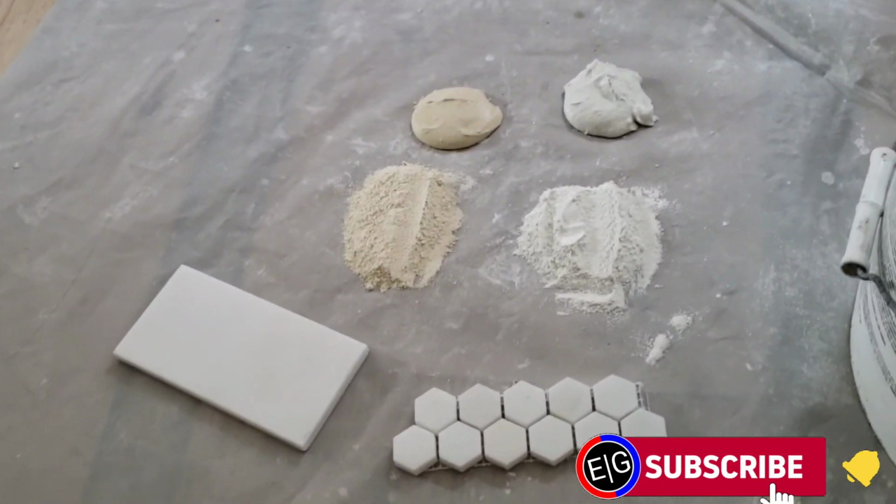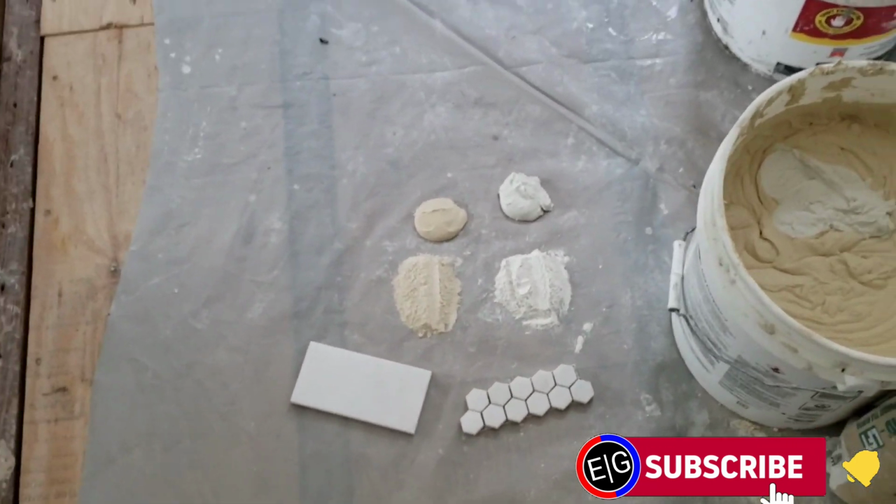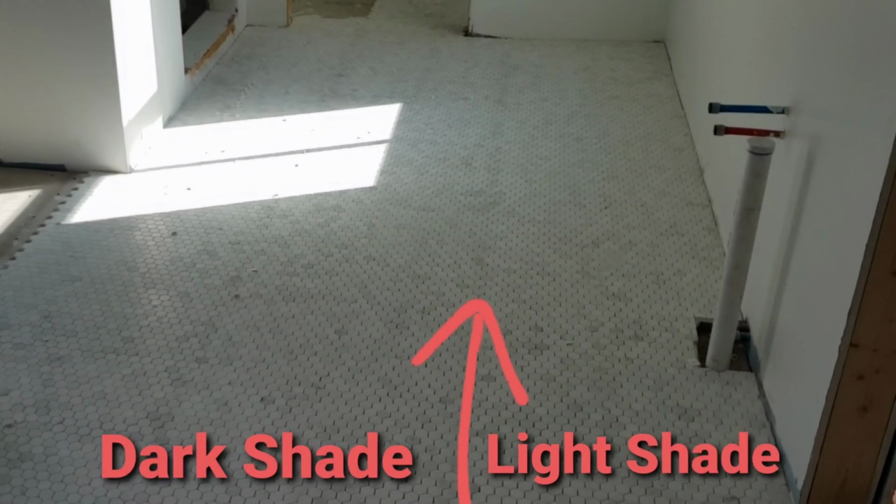So when you're installing white marble, make sure you use a true white Thinset, because look at this picture. On the left side is a darker shade, and it's only like that because the Thinset has not dried yet. The right side is a lighter shade, and that's the color that the left side is going to eventually dry to, because this was the day before. The point being, if you were to use gray Thinset, which by all means you could, be aware that the white marble will turn a darker shade than what you would have expected.